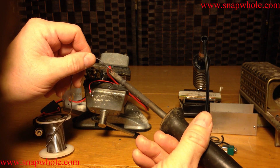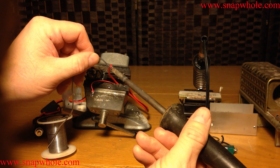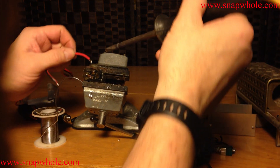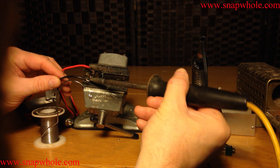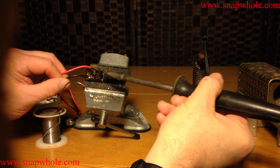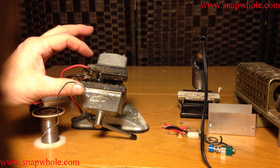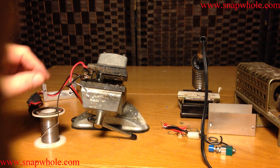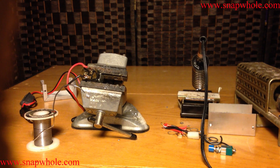Pre-tin the copper. If you just touch the solder to the wire and it's hot enough, it'll melt — there's no reason to touch the soldering iron itself. Those cables are getting hot to the touch. That seems to be a good connection, so that'll get power to the central strips. What I need to do is wire this connection to this one and this one to this one, and that way when the switch is activated the power will be reversed — that'll be my up and down.